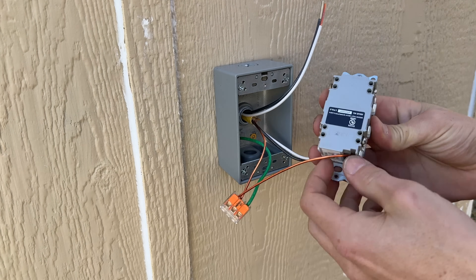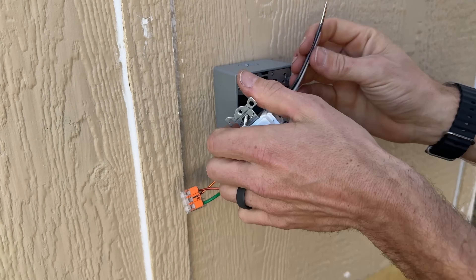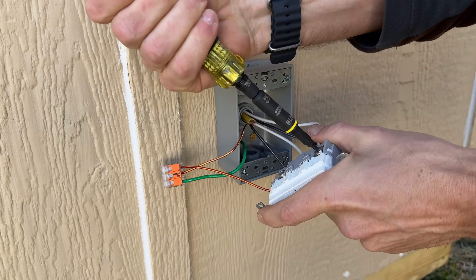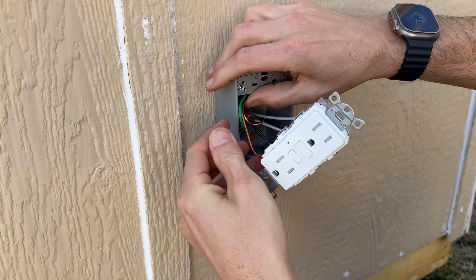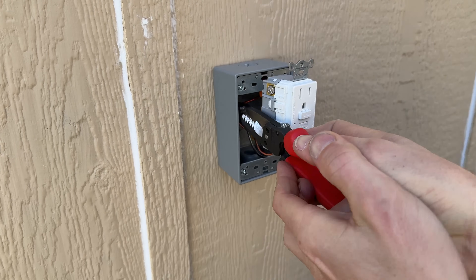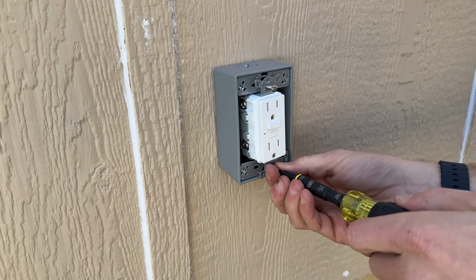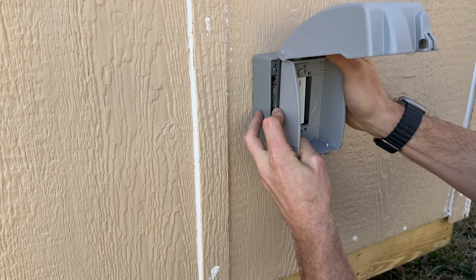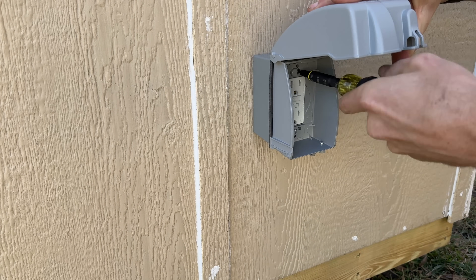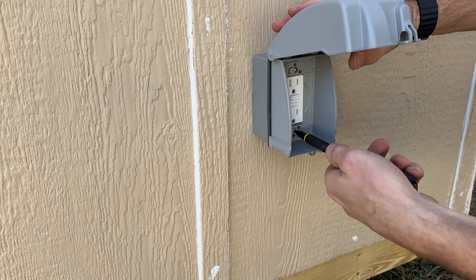Now tying everything together, we'll plug it into the portable power station to check things out. That plug in my case goes into the line side — or for you, that's the 120-volt 20-amp circuit coming through your conduit — going directly into the line side, then the neutral and hot going into the load side, which will then feed the duplex outlets and also the lighting circuit. You'll tuck things back, and a GFCI outlet is a large outlet so in a junction box like this it's going to be a pretty tight fit. Take your mounting screws, get them started, then place the in-use cover over them before tightening — those same two screws hold both the cover and the GFCI. Hit the reset once you plug everything in to test out your circuit.